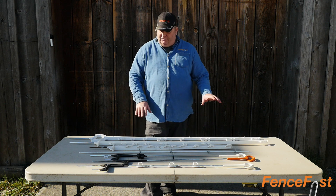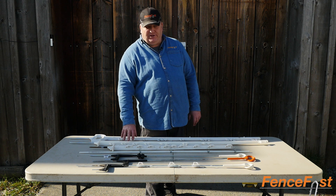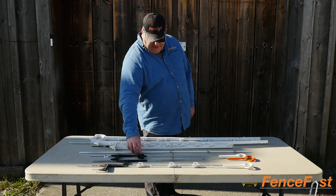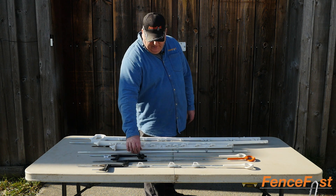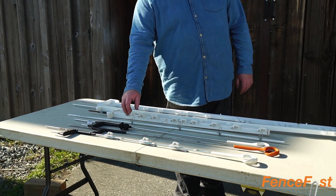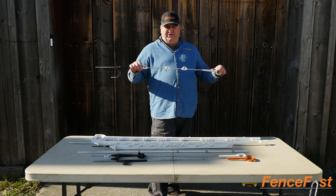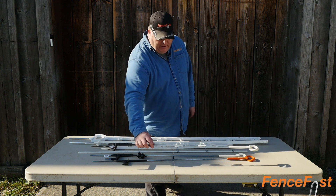So those are our mix. For horses, deer, or bison, you want something taller with these first big ones. The shorter posts would be more for your sheep, goats, and multi-wire pig fencing. The fiberglass post can be used for single to multiple wires — you can add as many clips as you want. The two ringtop posts are more for horses or cattle where you just need one or maybe a second wire. The ring top model is also what you'd use for multi-wire setups with sheep and goats, or positive-negative systems in winter.